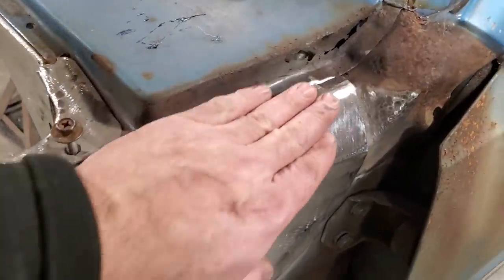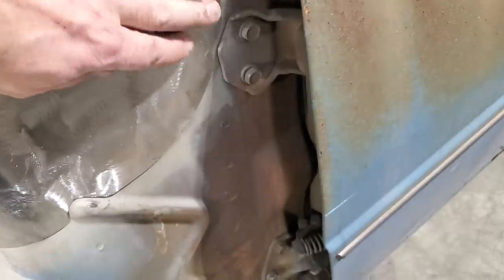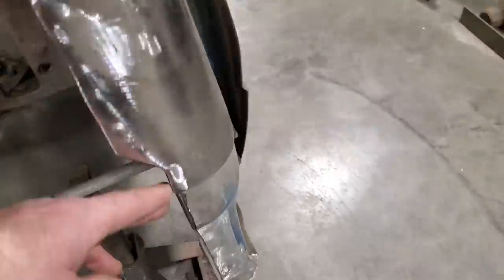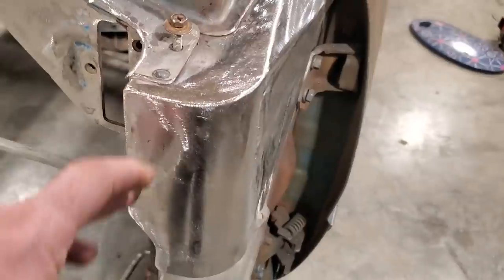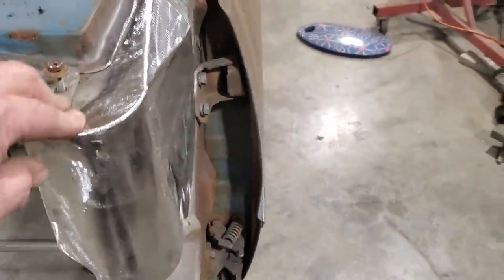Right, it flows in up across the top here into the original top piece. Spot welded down along there. Looks like an overlap panel coming in around here. And it's all welded up through here and all ground up smooth. Nice round edges on it all. Looks like a finished type piece. Got the reinforcement plate in behind it so I can drill and tap it later on.